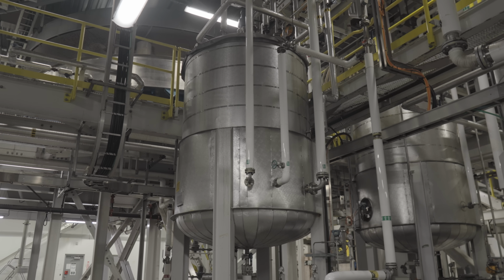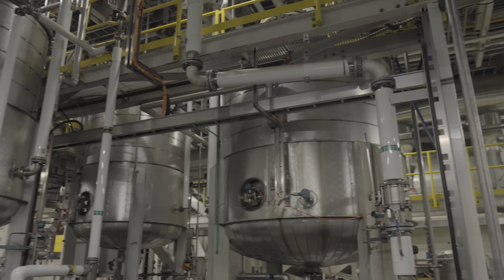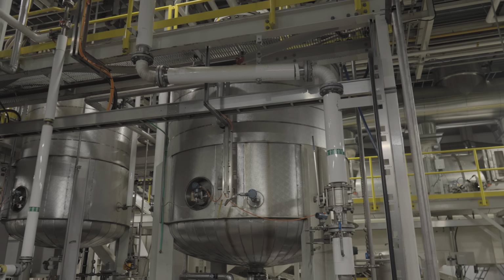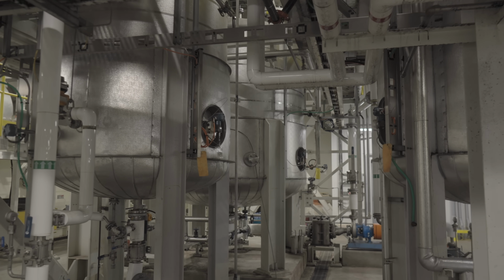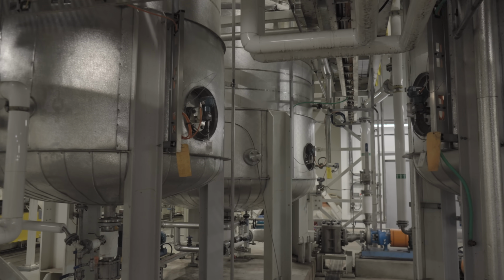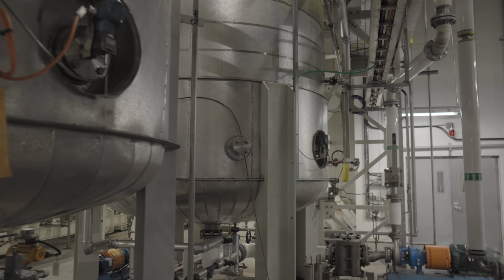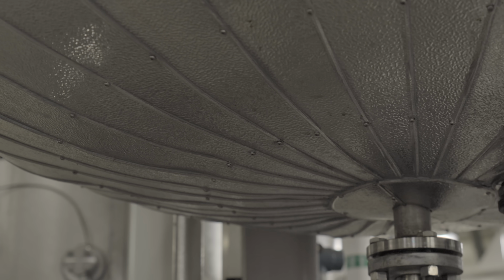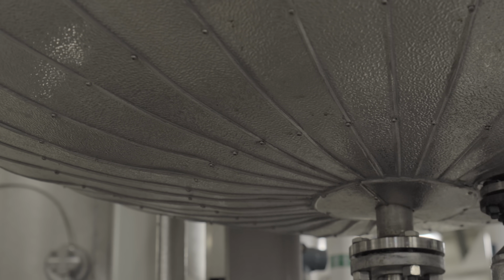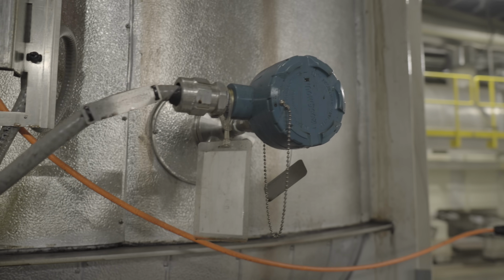During the process, the GCE is circulated through the tanks, being moved away as it reaches higher and higher caffeine concentrations, and it stops being an effective solvent. It's then taken away and passed through that active carbon process to be both decaffeinated and also cleaned, and then returned to the tank. Their formulation of carbon is specifically designed to trap caffeine, while interestingly other manufacturers use a formulation of carbon that is specifically designed not to bind the caffeine.